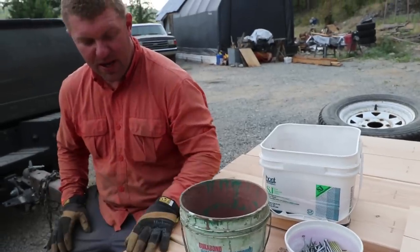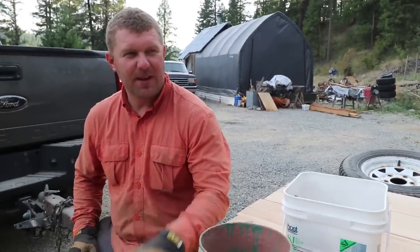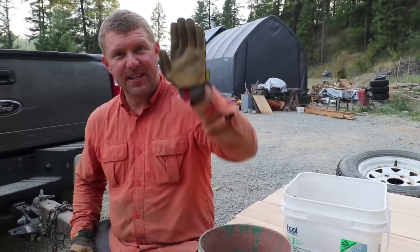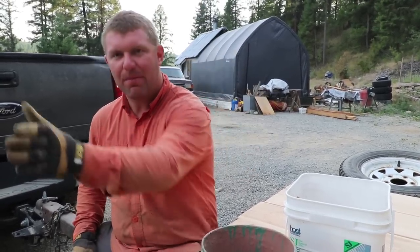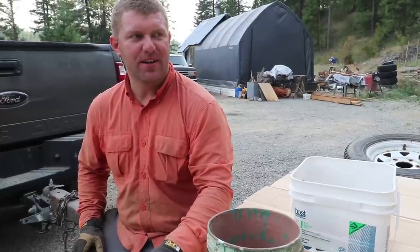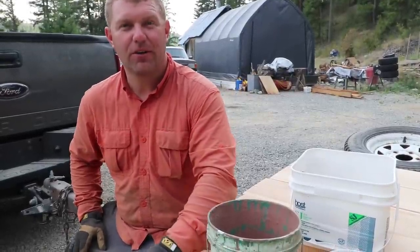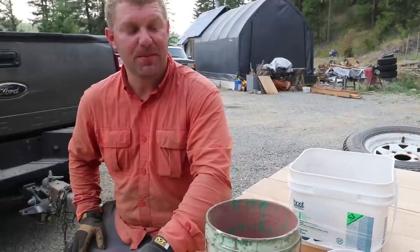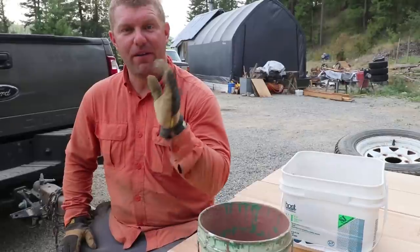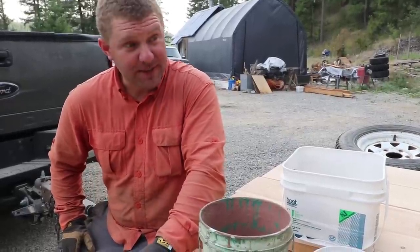So for lumber, really critical. We paid a premium for this lumber because we needed lumber that's straight, doesn't have crown in it, doesn't have a bunch of bow in it, it's not warped, and it will make our life so much easier instead of battling warped and twisted boards. That's something that we learned on the concrete pour that we did for this other gentleman. One of the things we learned was the value of a flat, square, true board, especially for footings.